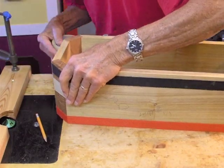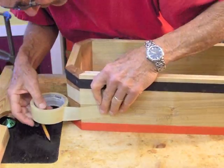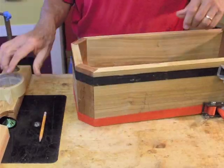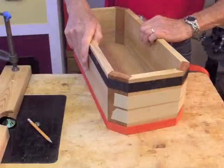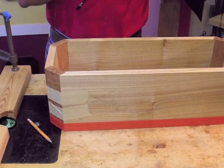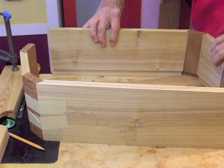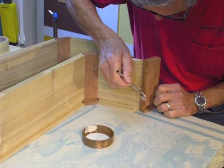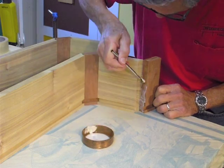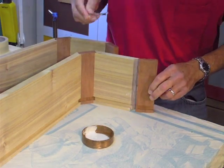The tape helps a lot in speeding up reassembly during glue-up. With the tape in place, we can remove the band clamps and each set of four parts can now be handled as a unit. As you can see, handling them this way allows easy glue application, and for each of the three steps in the glue-up, speedy reassembly of the body with every part in exactly the right position.